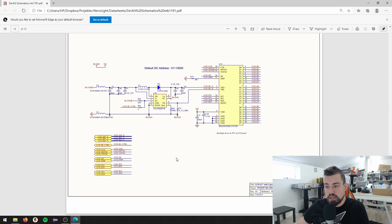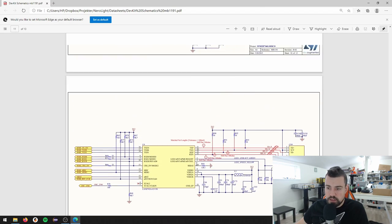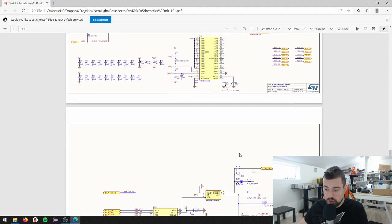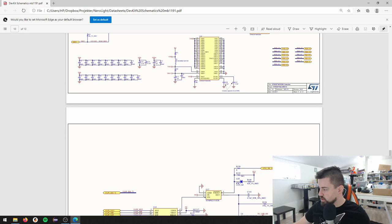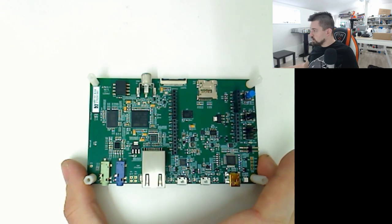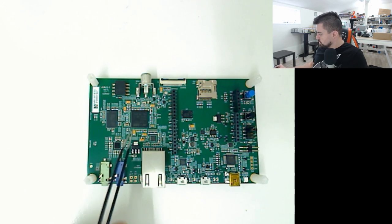If you're doing this in real life, I would suggest starting by printing this out and getting an overview of what connection is what. Then just remove all the pages that you don't need. If you don't need the camera connector, skip it. If you don't need Ethernet, remove that, and the USB and the audio codec. On this discovery board you have a lot of chips. Let me just turn this on. The main processor here is a BGA package.